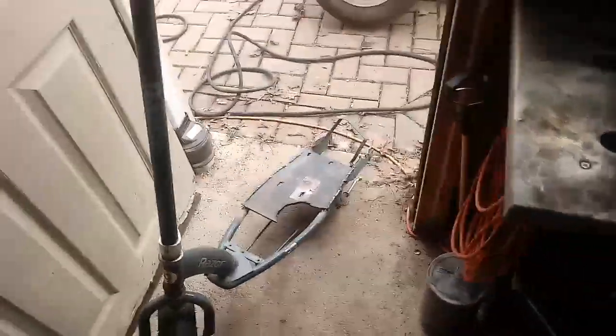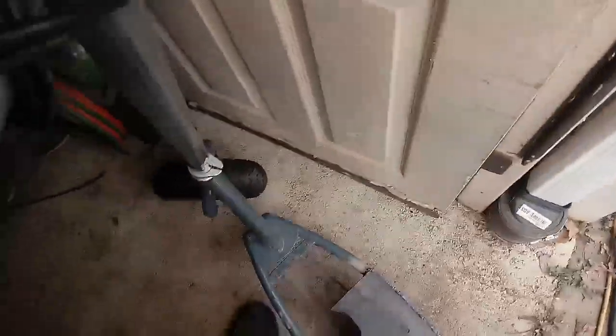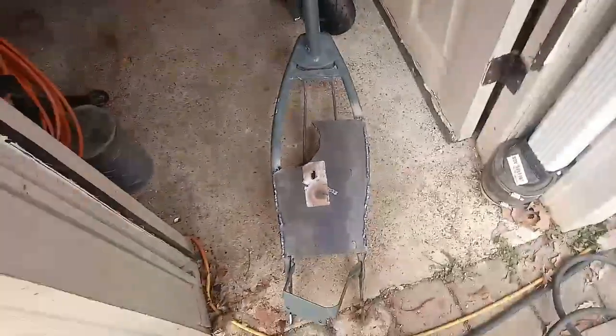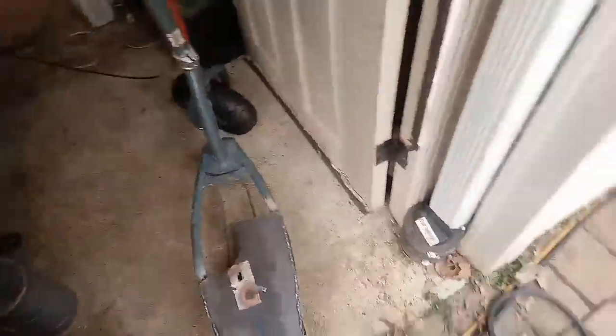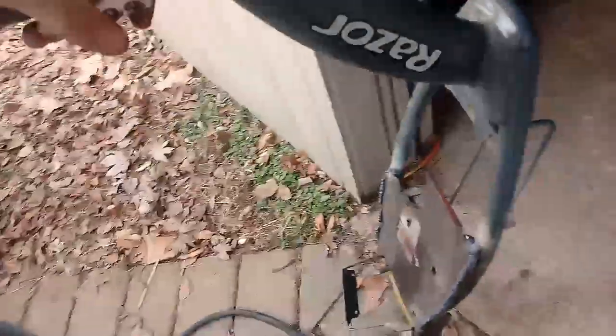Alright, so my plasma cutter stopped working because the tip was messed up, but I found the tips that came with the machine, and I put those on there, and I cut the rest of this off. The welds are really bad because stick welding is hard, really any kind of welding, when you're welding big thick steel to little steel. But I just kept doing layers and layers. You can't really see them, but they're really strong, so that won't be an issue.